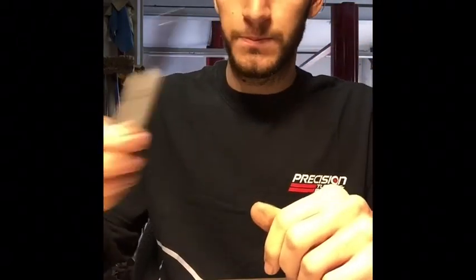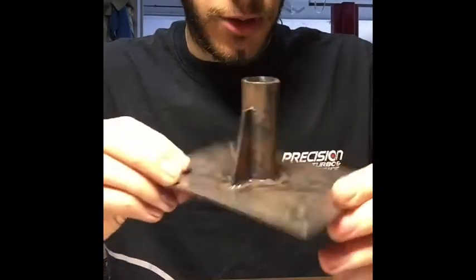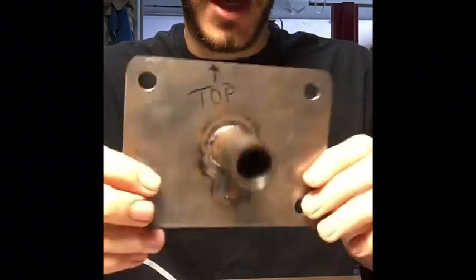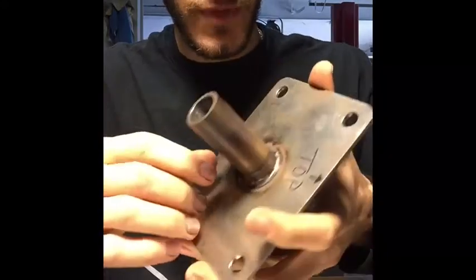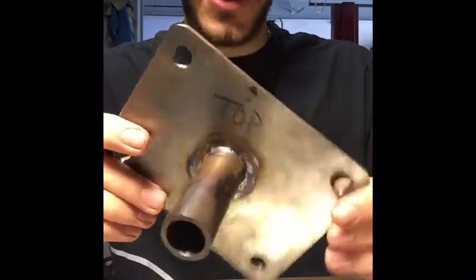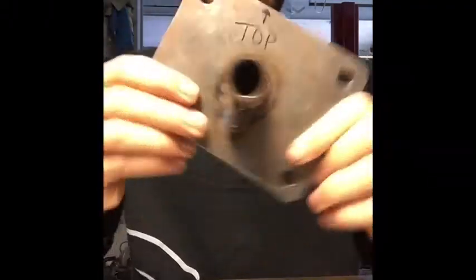With these basic tools I just went over, I made this motor mount for my S14 twin-turbo LSX. This was just a practice one — it's only 18-gauge steel, I'm using 3/16 for the final metal thickness. But I made this with all these tools right here, nothing else. I used a chop saw or bandsaw to cut everything, but everything else was done with a drill and these tools.